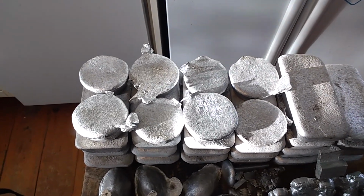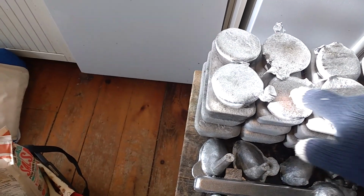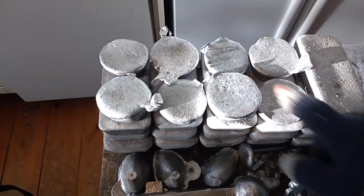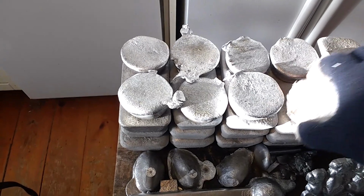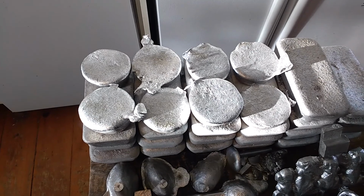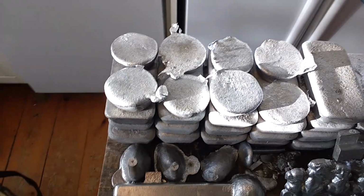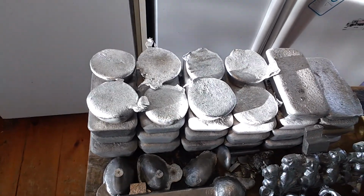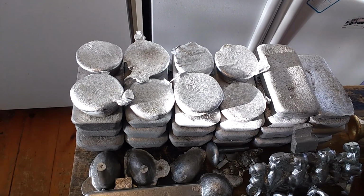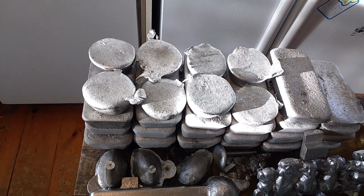You guys melting pop cans, I know that when you pour your muffins, there's a big dip in the middle. It shrinks way down, right? That's what you get when you use good quality cast aluminum. A lot less shrinkage, so you can make better castings with a lot less effort. You can spend half your time designing risers and stuff to deal with the shrinkage you get from using extrusion or pop can metal. But why not just get some old alloy wheels some guy doesn't want anymore?